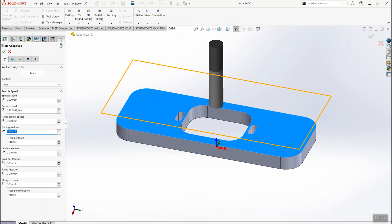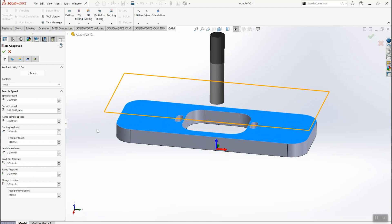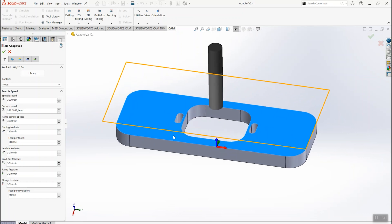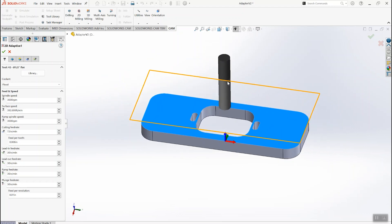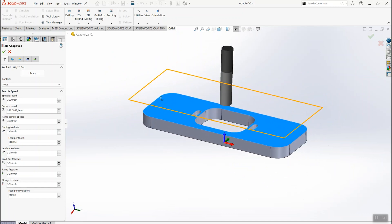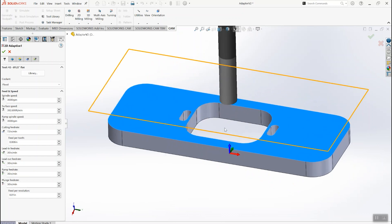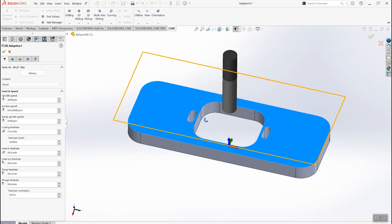And this number for me is like — I never go this fast with this machine when I'm machining metals. It's closer to 20 inches per minute or something like that. So this is really cool and fun to see. And we're doing it with a half inch cutter taking quarter inch step overs, no less. It's pretty darn impressive if you're used to watching your little bench mill chug along machining metals.